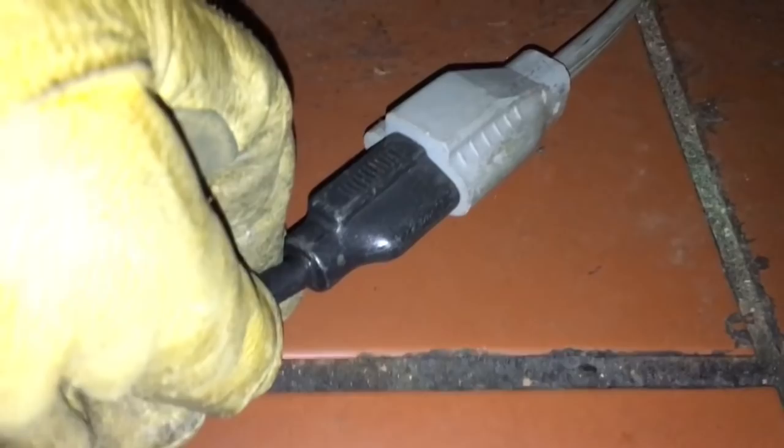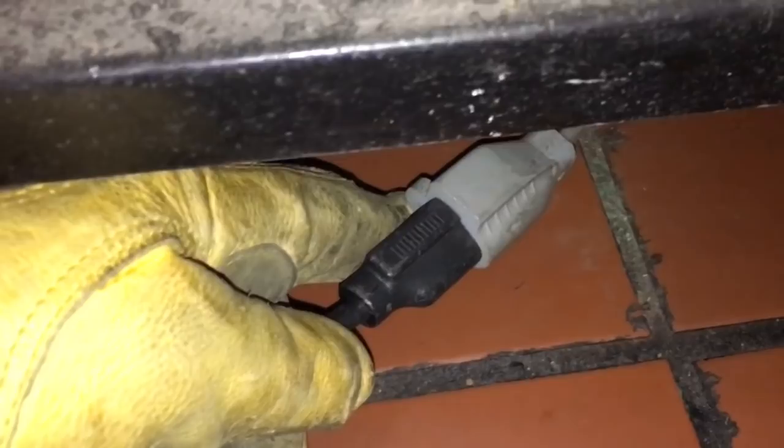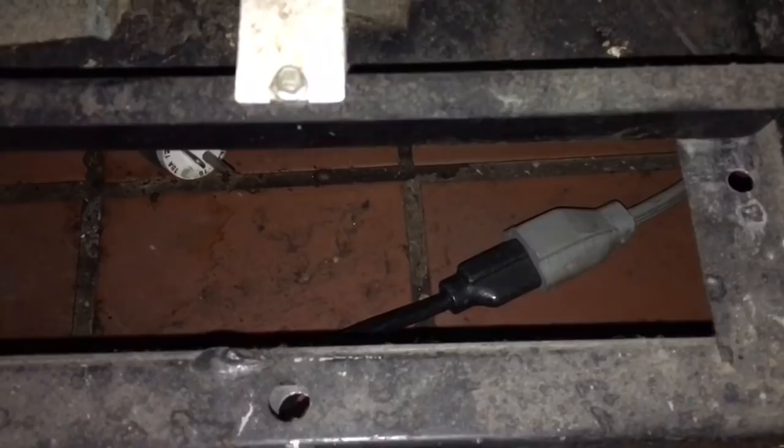Whenever you got refrigerators that are stuck up against the wall, I always run a heavy cord from the wall outlet in the back up the wall. So you can disconnect the power down here on the floor. That's a little trick I do. So you can always unplug the unit, because sometimes you don't want to roll these boxes when they're full of product. The wheels get messed up. Wheels don't like to move sometimes, so that way you don't have to roll the box out to unplug it. Little tip and trick, tip of the day.